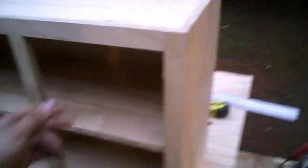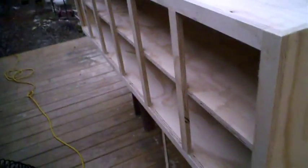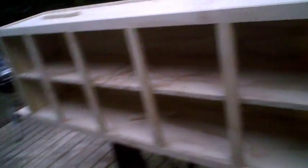Tomorrow's going to be all about wood putty, sanding, and staining. I'll do the wood putty early in the morning and then staining, hopefully. I don't know if I'll get to polyurethane, but I'll at least try to get to staining. For mounting, I put the brads going from down here — two-inch brads, two on the bottom, two on top, one in the middle, all the way across. That's plenty strong. I'd say it looks pretty good to me.